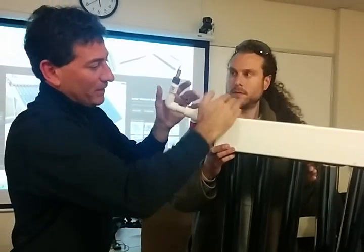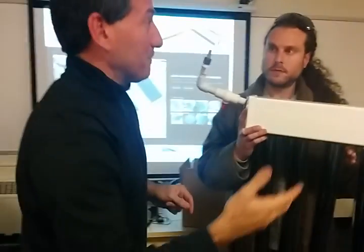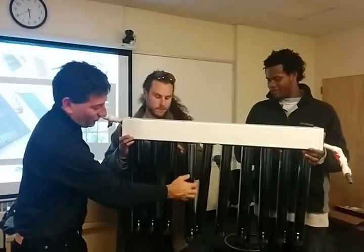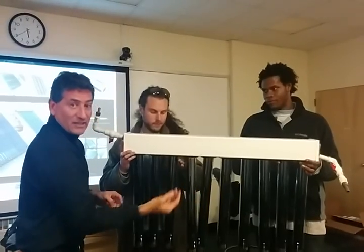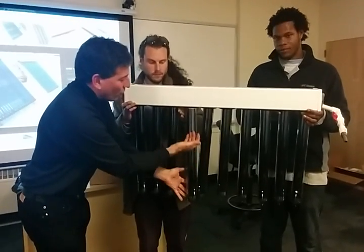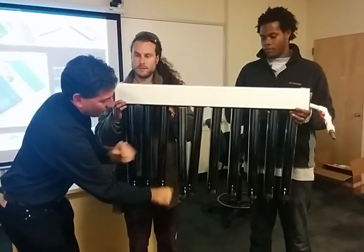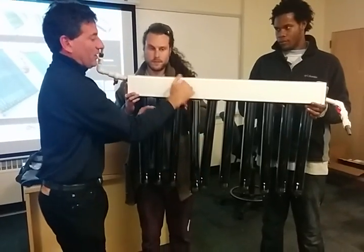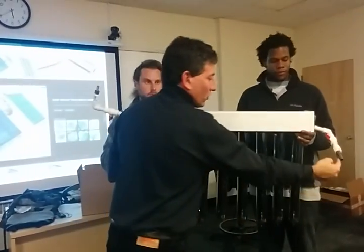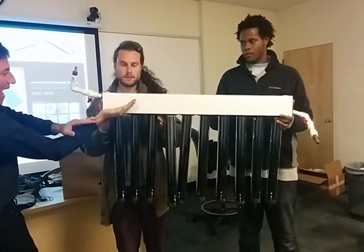You've got the ability to sit this in the sun — we'll build a stand for it — and the sun's light, which we proved today even on a really cold day, will be transformed into infrared radiation as it hits the black metal surface here. It will transmit that heat to the water inside, so that the cold water in the back will be heated in the front and will begin to rise, pulling more cold water down the back. You'll get this thermosiphon loop as cold water falls down the back, hits the sunlight, heats up the front, and this whole thing will start to fill up with hot water. At that point, you would run more cold water in here at a slow trickle rate, and it will push the hot water out and up.